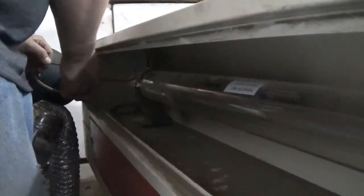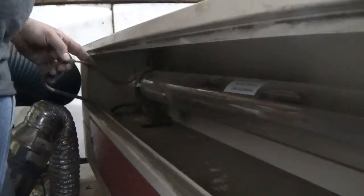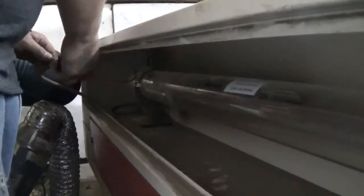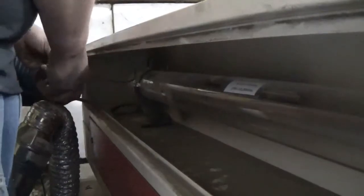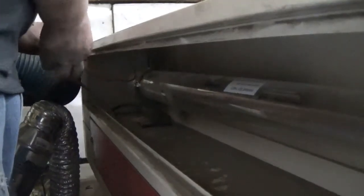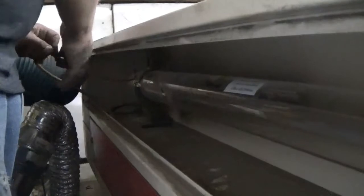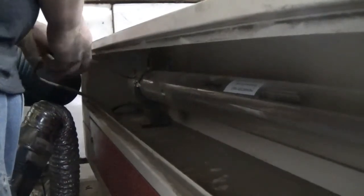Then we're ready to take the surgical hose — you should have some of this if you run a laser. This is the same hose you use for your coolers to hook up your water. I'm going to bring it over top of the other side; you want to overhang it about three inches on both sides. You really ought to have a line going all the way back to your power supply. Then at that seam, I'm going to go ahead and wrap it with high voltage tape — but you could use electrical tape at this point.